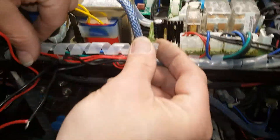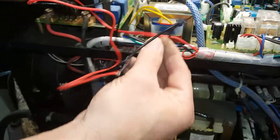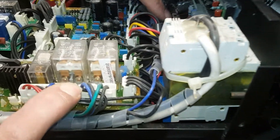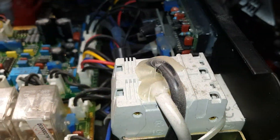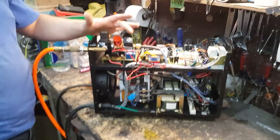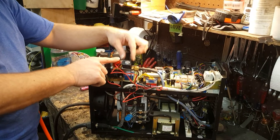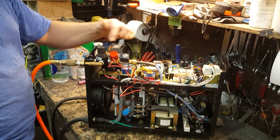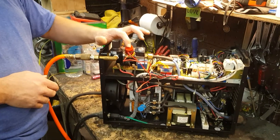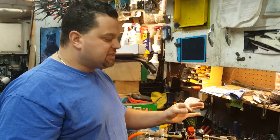There's a wire loom over here I had to cut off and remove. I'll put it back together. These two wires - one goes to this solenoid and the other one goes up to the switch up front. Just follow the wires, you'll see them, it's super easy. Most plasma torches have the same process - a pressure valve to make sure you have pressure. This tells the computer how much pressure is coming through the line. If it's too low it won't set a plasma arc, or if it's too high it causes problems. This solenoid just lets the air flow on and off.